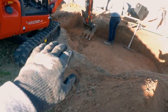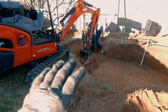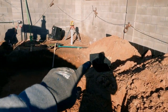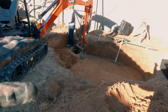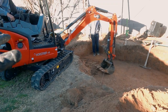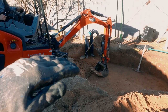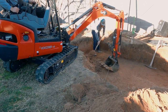We're figuring out what water depth we want to deal with. Normally we'll have anywhere from 9 to 11 inches of water on top of the aqua block in the intake bay. But for the nature of this project — it's more for turtles and small tortoises — we're going to make that intake bay a little more shallow, so we have an easy slope into and out of that area for those guys.